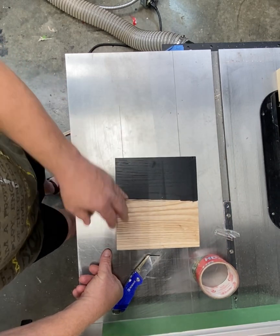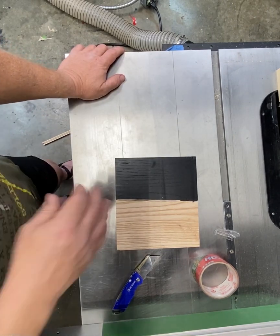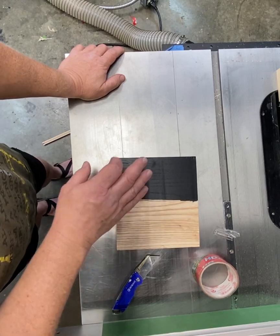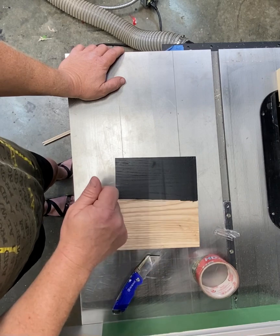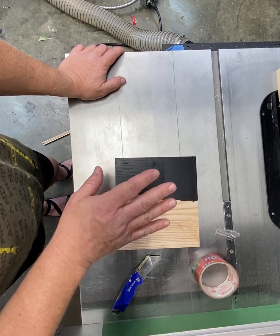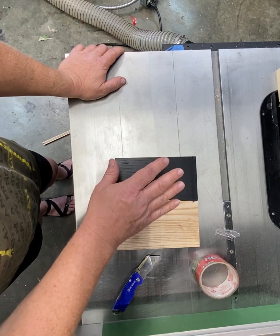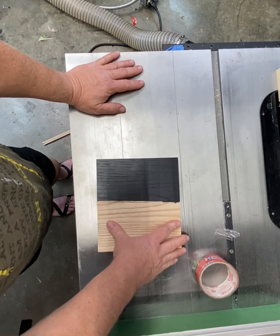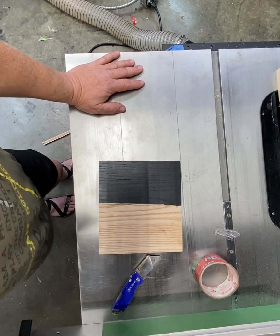I have plenty left — it goes a long way. It sprayed really nicely, and what I really like about this polyacrylic is that it dries pretty fast, but not so fast that it leaves brush marks even when you brush it on. It levels out really nicely — it has a long enough open time to really flatten out and give you a smooth finish. If you have any questions, drop me a comment and I'll be happy to answer them. Thanks for watching.